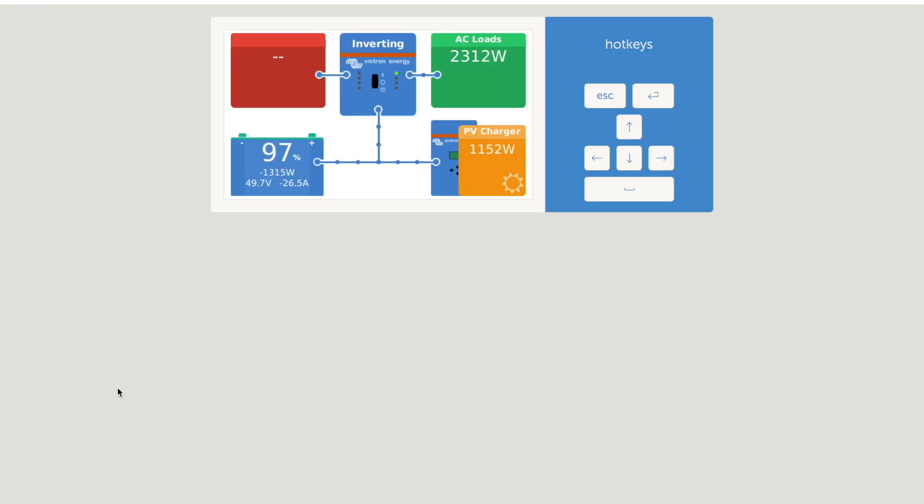The TV is on — that's had almost no impact whatsoever. Something's actually dropped down because it's gone to 2,200 to 4,000 watts. It looks like at the same time the tumble dryer is up to temperature, so switching on the TV had absolutely minimal impact. We'll keep an eye on this because although our inverter can cope with a surge of up to 20,000 watts, that's not something we want to do. We're going to try a few other things through the house.